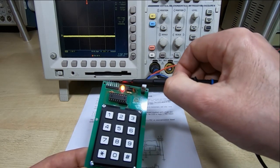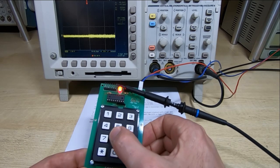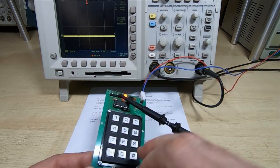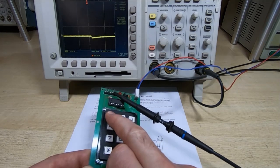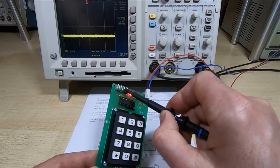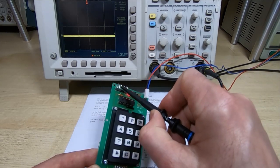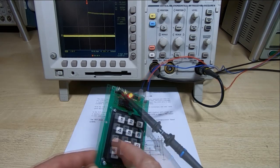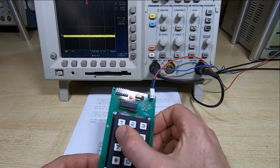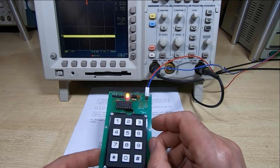The scope responds correctly to key presses on the first BCD line. We check the next BCD line with different keys, then the third, then the last — and all four BCD output lines are responding as expected. It appears to be working the way it's supposed to. It was simply a case of there being no firmware in the PIC. I'll now program the remaining units he sent me, send them back, and hopefully that has resolved the issue.